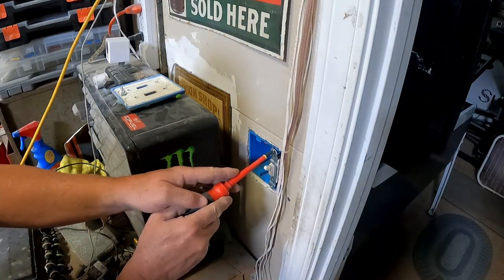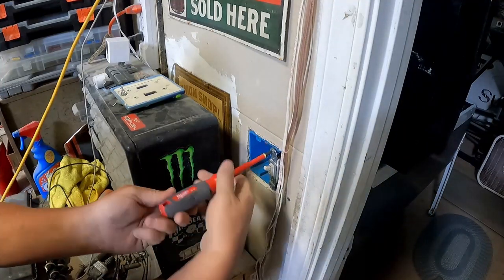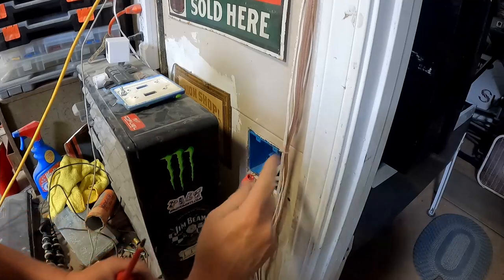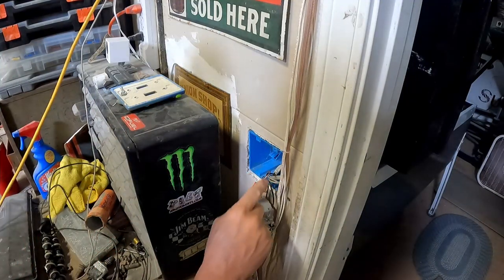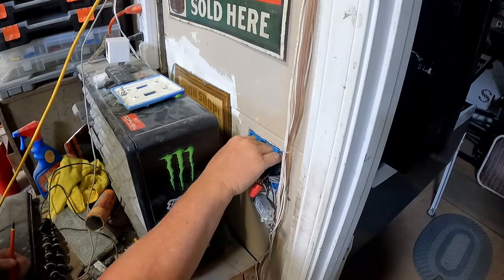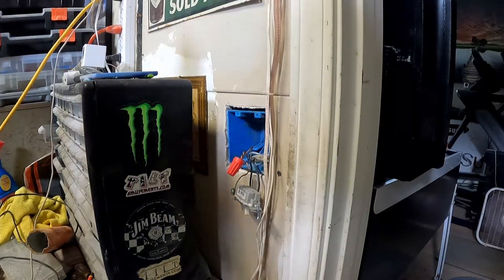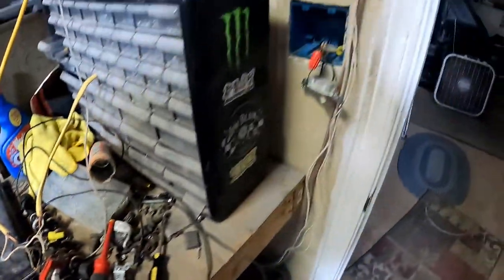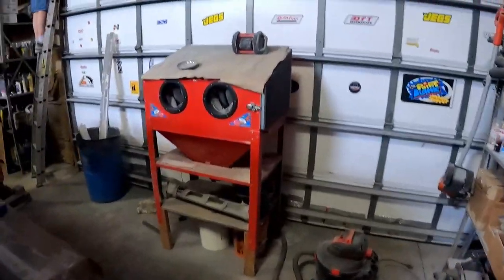Pull that out of the way so we're not getting shocked when we mess with it in there. We could turn that leg off too. It goes on and up and feeds the lights - and now we've broken the hot side. We can get in there and put a hole in here. There should be those angled slots in the back we can punch out and run the fish tape through. So we'll cut that switch out, leaving a couple little legs, reroute, and put the switch in the wall after we run new wires down.